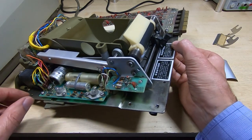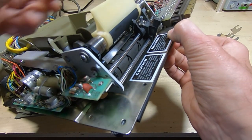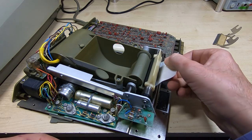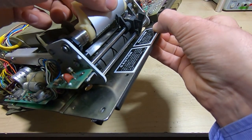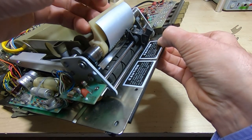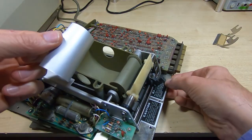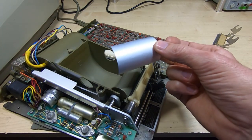It's a very critical adjustment. The fingers are currently touching the rubber roller. If I lift this up, you can see that there is now a very small gap between the end of the fingers and the rubber roller. What I can do now is feed paper through that gap — if I try to feed this paper in, it will go through and fit between the fingers and the roller. So this is now free; it will move in and out quite freely, it's not catching. But if I put this back down, the fingers come down and they grip the paper. This is now gripped fairly tight — it won't move. If I lift this back up, it will just come out. So that's what the adjustment is for. It is important that when the arm is down, the fingers make contact with the paper or the printer won't work — it won't detect the paper.